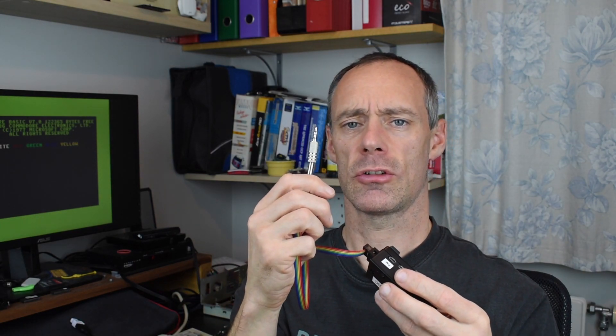Once you've reassembled everything, aside from the USB power input and the mini-HDMI video output cable, you'll need to make up a special cable which has an IDC connector on one end that plugs into the analogue board video input on the RGB to HDMI, and a TRS cable that can go straight into the video output socket on the back of the Copper Dragon board.